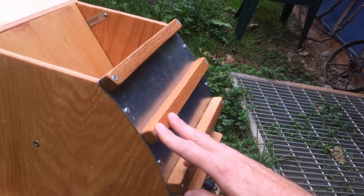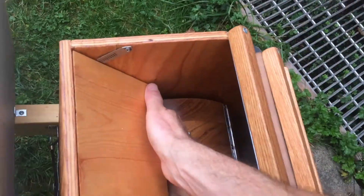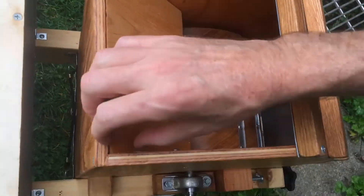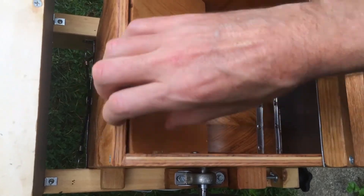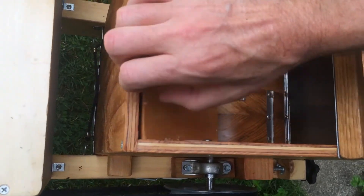The particular curve of this aluminum I actually wrote a little program to figure out in Blender. The idea was to have a continuously decreasing distance from the axis of the drum with a little bit of a fade in and fade out at the end — it's kind of nerdy. I'm not really sure in the end if it was necessary to worry about it that much, as the apples bounce around all crazy no matter what you do, but I kind of like the way it looks. There's a wood board here to stop the spray that would kick up from the backside of the drum. It's easily removable with these little clips when you want to clean things out — with two hands it comes out real quick.